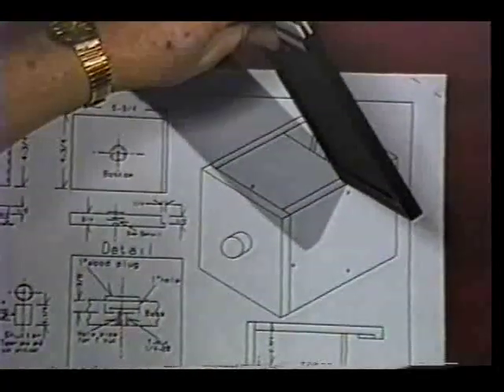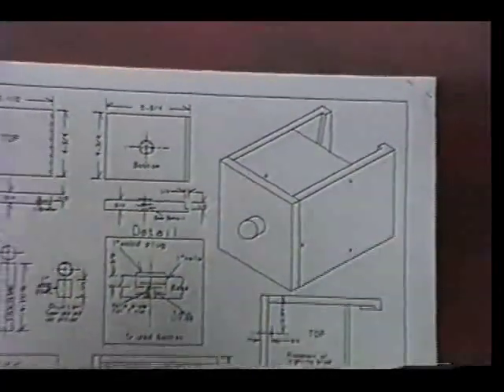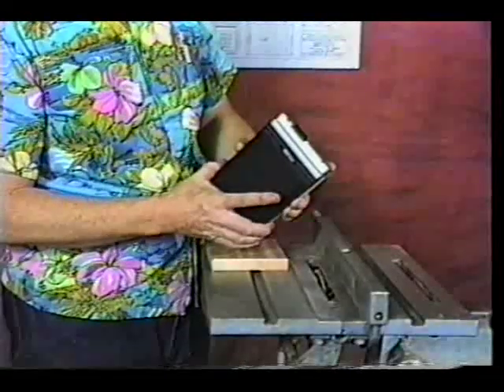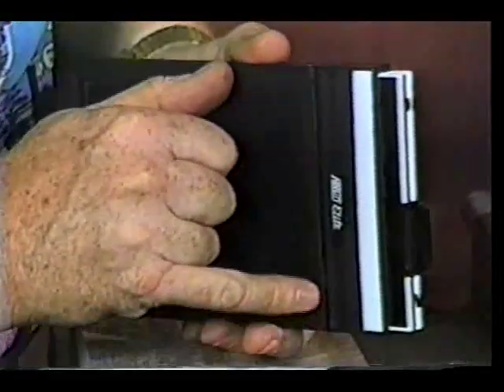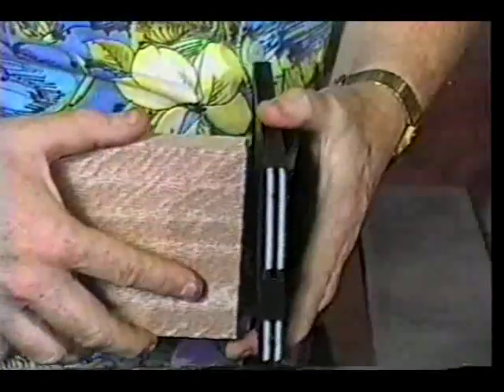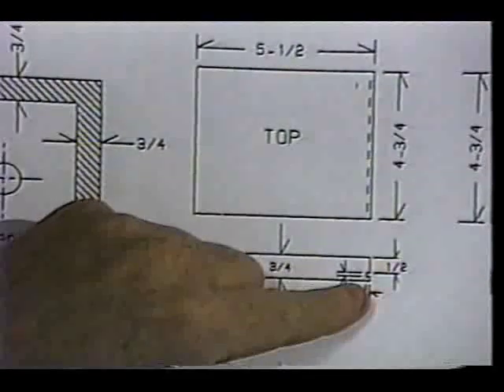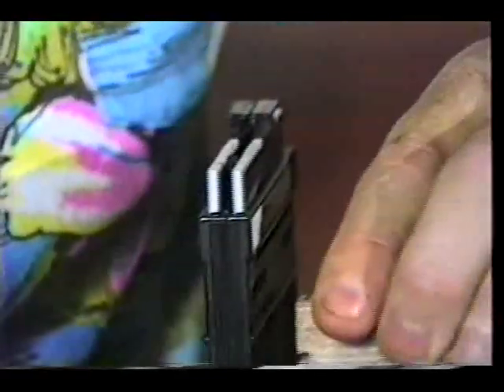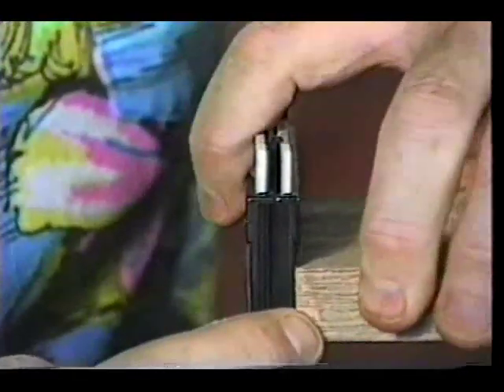The holder sits in the back of the camera. Notice the bottom piece and the top piece are exactly the same width as the holder. The top of the holder has a little projection point — this is a light trap. It keeps the light from coming in at the top of the camera, and we're going to make a slit in the top piece to match where that light trap hits. It's just a little eighth-inch deep by eighth-inch wide cut, one saw blade width, and it will sit right into the 4x5 holder. This also locks the 4x5 holder so it doesn't accidentally slide out.